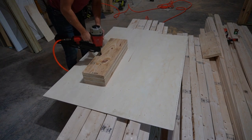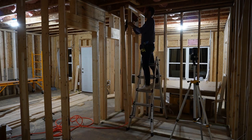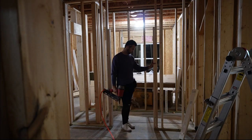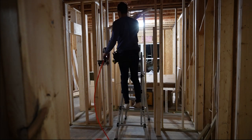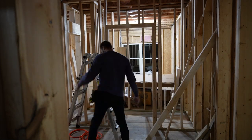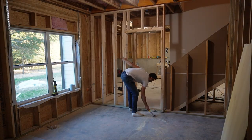There are a couple different ways to frame a wall. The more traditional method is framing it on the ground and then standing it up. The other method is framing it in place. While it's quicker to build the wall on the ground, I actually recommend building in place if you're framing a basement, for various reasons — space being the largest one. If you want my full-length video on how to frame a basement, I'll have a link in the description.